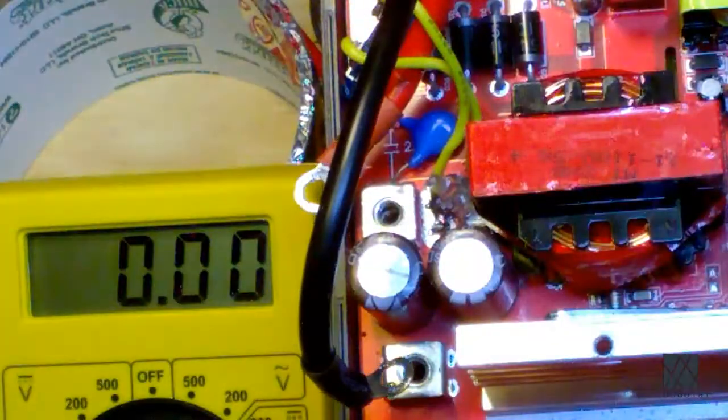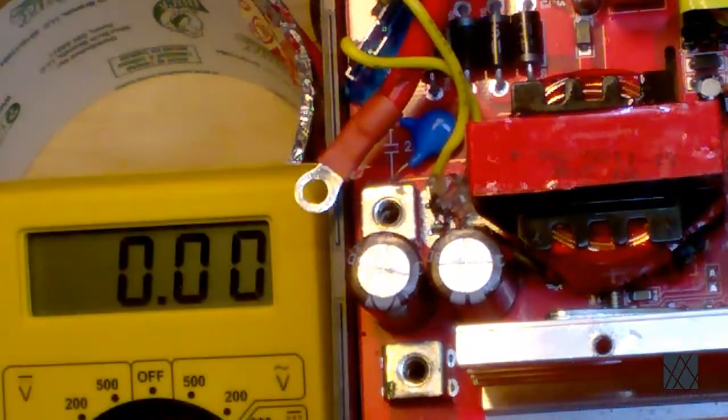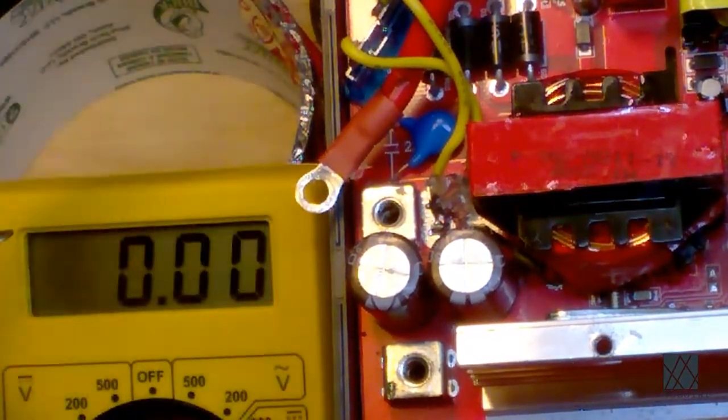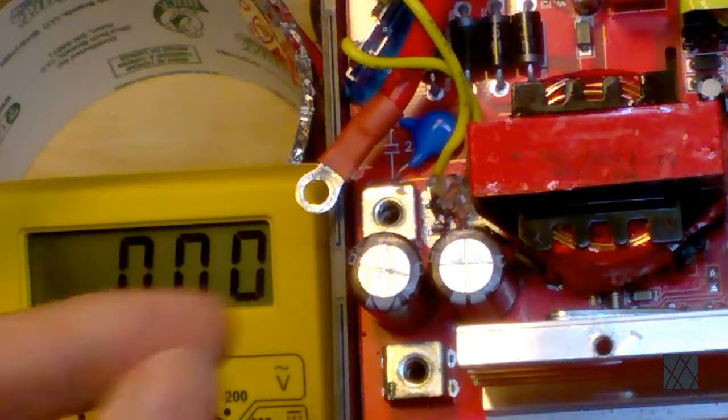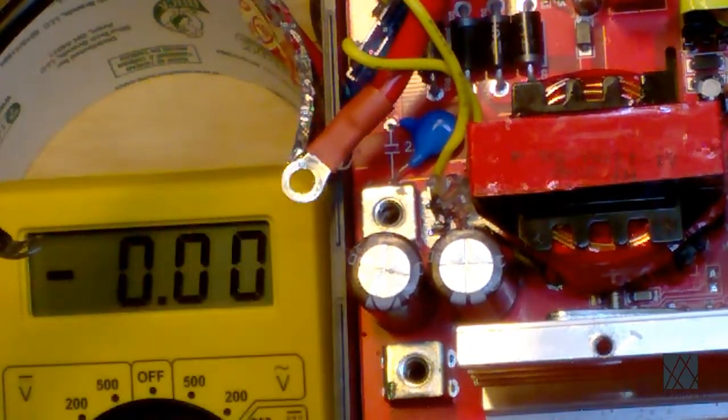Okay, so now the battery pack has been completely removed. And make sure you don't short them together. Even though it has a BMS, you don't want to risk that. That's a very high-powered pack. It's capable of delivering probably over 50 amps, and that would create quite a spark. And you want to be careful not to let these touch the circuit board anywhere that you don't want voltage going. So now the unit is basically disarmed.